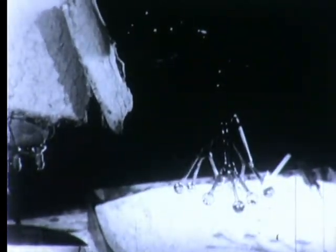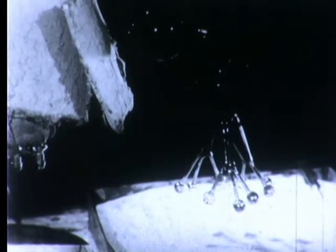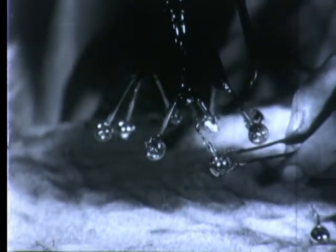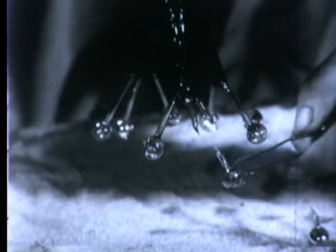Follow the arrow and watch the empty ball — there it goes. The argon gas is chemically inert and will not affect the sodium. Then each little pellet is sealed off: a tiny parcel of pure sodium, just the right amount for a sodium lamp, about one-eightieth of an ounce.